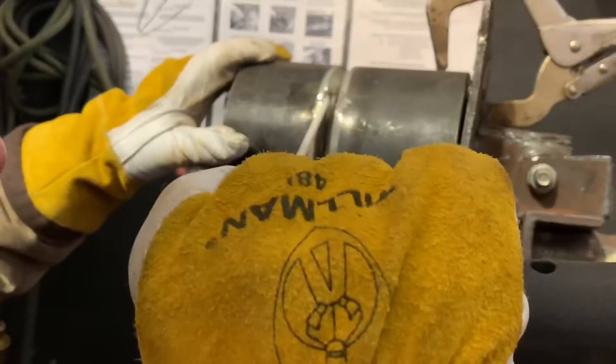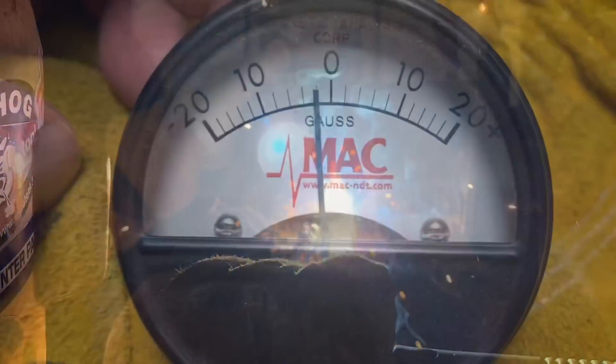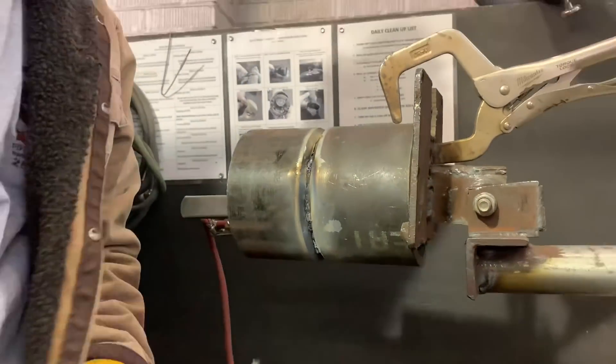We've got some problems here — one of these coupons was magnetized, probably been recut and beveled 10 times in the last week. We switched the ground over to combat that a little bit. You can pull out a gauss meter and check your pipe to make sure it doesn't have any magnetism. Your ground, the rods, the age of the rods — all of that has to do with how that arc performs. If you've got the arc riding one side of the bevel, you can point the rod away from that bevel to try to fix it. I always like to shake the rod back and forth a little as I'm coming up — that helps stabilize the arc between the two bevels. There's some tricks you can use to combat what they call arc blow.